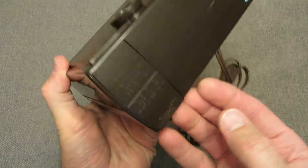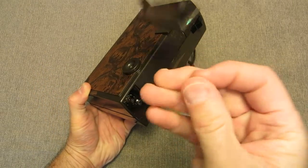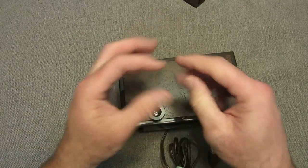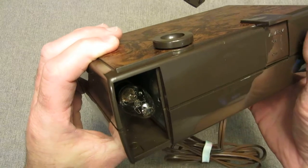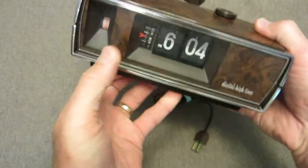How it does that I found very interesting. This here comes off, and a lot of the clocks — if you're looking for one or if you've seen them on eBay — this piece is missing. It's a basic 7-watt light bulb. There's a little hole in there, a little viewing port. The light will go through that port and through a wheel that's about this big. The wheel has very small numbers on it, at every five-minute increment. The wheel is attached to the mechanism that turns the clock, and it's supposed to be in sync with that.